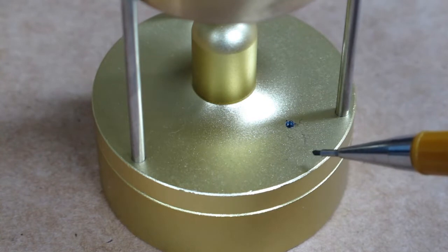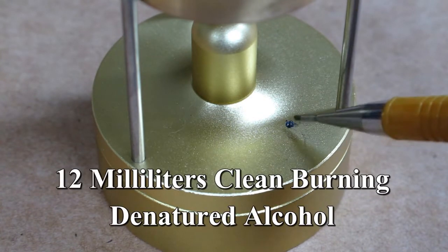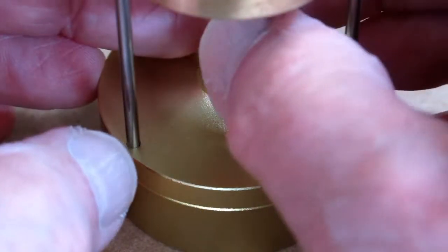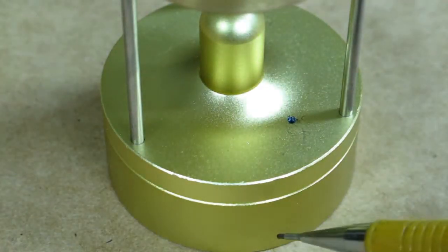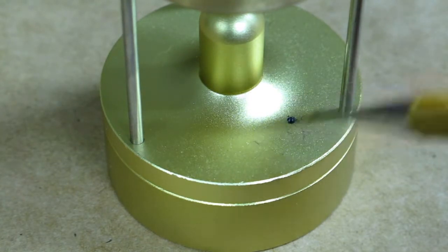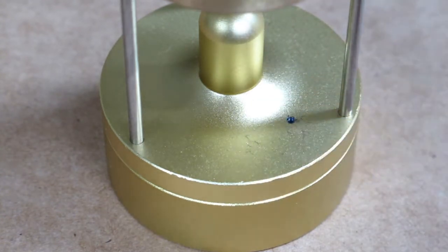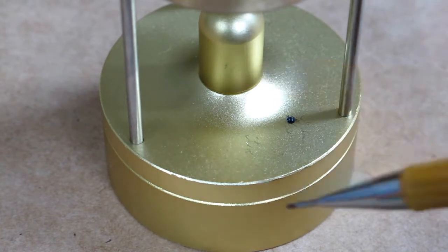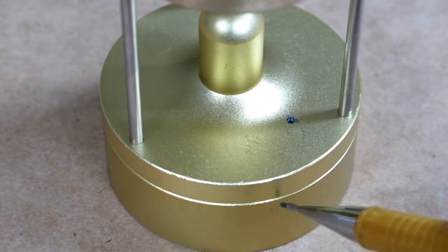If you know the alcohol burner is empty, you can use a syringe. Put 12 milliliters of alcohol in through the vent hole. Easiest way to tell if it's empty is if the wick is dry. If the wick is wet, then you want to be careful — you do not want to overfill this. One thing that happens with every one of these burners: the heat from the fire reflects off the boiler, comes down and heats this up. And the hotter this gets, the bigger the fire gets. So you only want to fill this about two-thirds full, max.